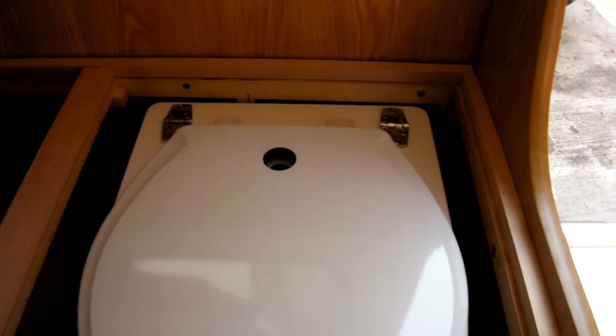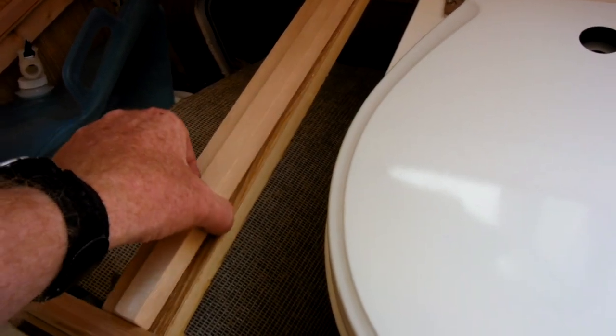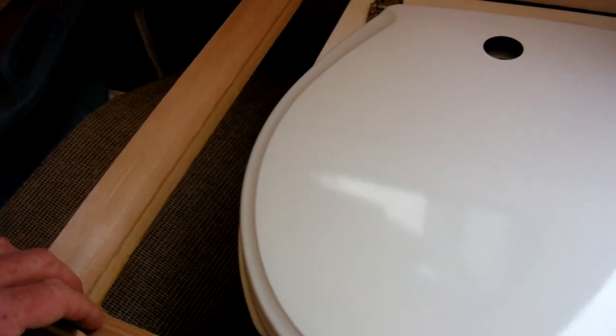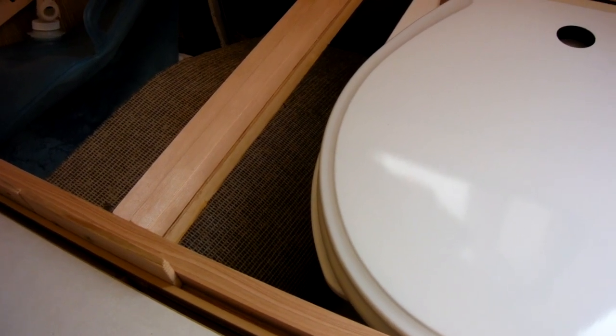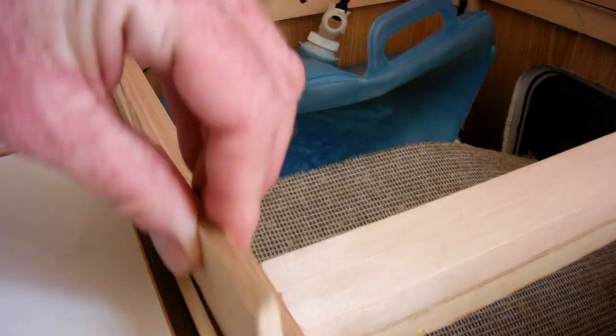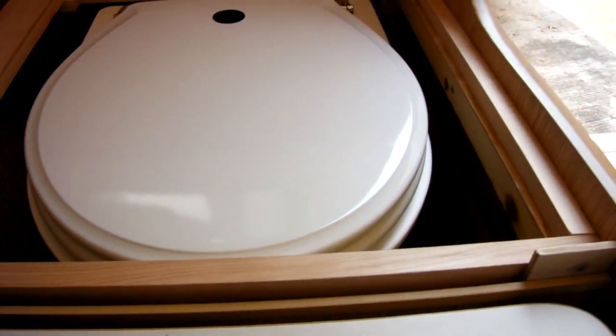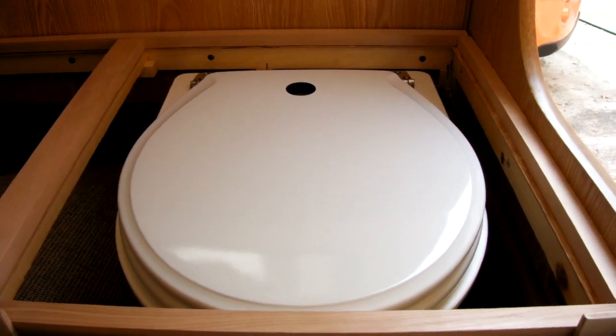After going back to the hardware store to get three-quarter by three-quarter inch molding — just hemlock — here it is, all in place. I'm just setting it down to make sure everything fits. Because I've been raising the base of the seat, the filler board has potential to slide out, so I had to put some tabs in. I cut some pieces of recycled wood — some old wood slats — and they fit perfectly for creating a stop. I will have to trim out the filler board to make sure it fits in, but it's looking pretty good so far.